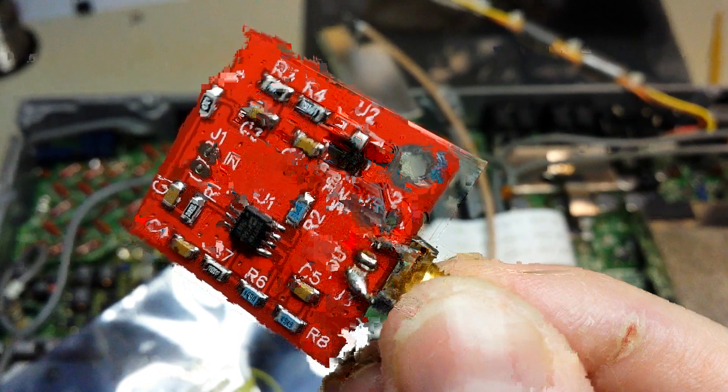The Clifton Labs board requires around 12 volts — I think it ranges from about 9 to 16. The spot I like to tap for power is right off the antenna tuner jack. If you follow it back from where we pulled it off, it goes into this jumper here. Looking at the wire colors: on this one, orange is the 12-volt line — the service manual says 14V, but that's okay.